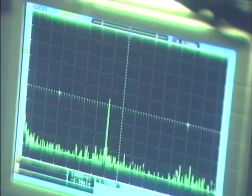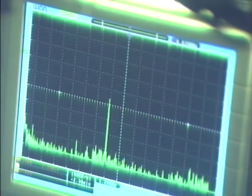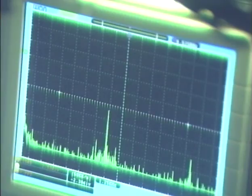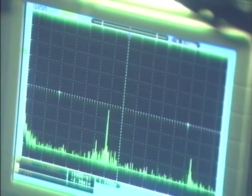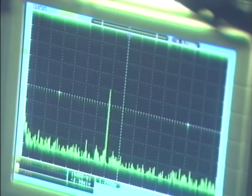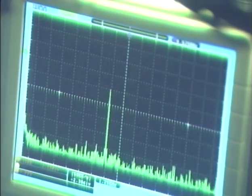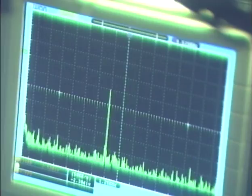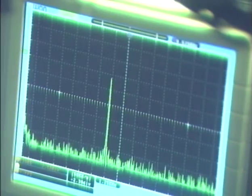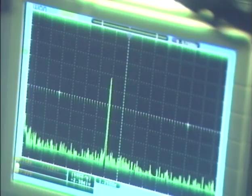Well, okay, I'm going to adjust it too far to the other side, and that wave is going to go back down like that. So I'll know I'm going in the wrong direction, and I need to keep adjusting my head, and I'll adjust it a little bit more towards the right, in the right direction, and now we're seeing that 8K wave come up a little bit more. So there's an even better adjustment of the 8K frequency.